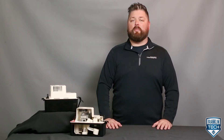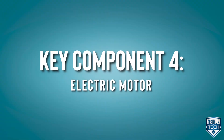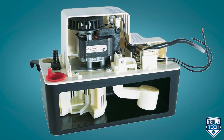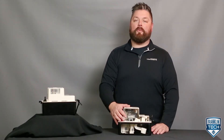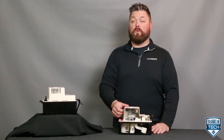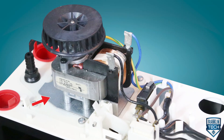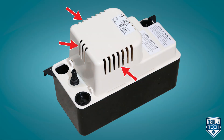These are the components you need to know related to pump operation. Operation for the VCMA is simple and reliable. The VCMA contains an electric motor. To keep the motor cool and increase pump life, the product has an oversized bearing and large cooling fan. The oversized bearing helps the motor operate smoother by dissipating heat, and the large cooling fan also circulates air inside. Both components cool the electric motor. In addition, the motor is attached to a galvanized plate, which spreads out the motor attachment, providing a larger surface area to hold it in place when the motor turns on. This also serves as a heat shield, preventing the plastic from overheating. Screen top inlets, or air vents, prevent debris from getting into the motor housing.